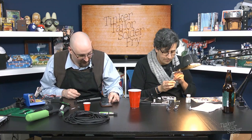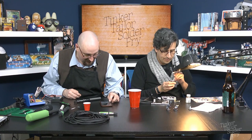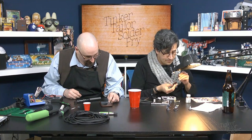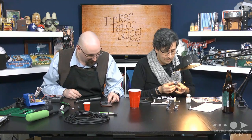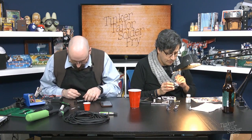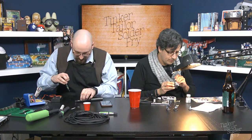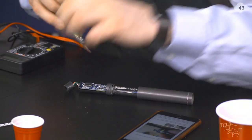Check for loose wiring on the bottom connector end. If no loose wires in the top capsule, then we'll need to look at the bottom connector end. This gets a bit tricky, as we need to slide the round flange off the top of the tube in order to push the bottom tube all the way out to expose the connectors. Locate the single silver screw holding the circuit board in place and remove that. Oh, goody. Oh, there it is, right in the center. Thank goodness that was easy. Okay, dump that in the screw top.